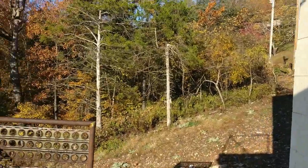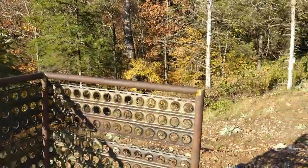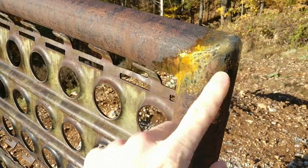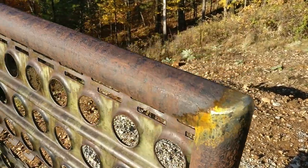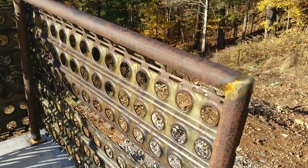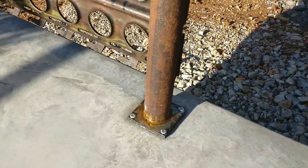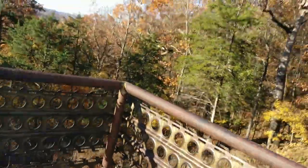I've finally finished the railing. It rained last night, so I'm going to let this rust a little bit and put the same rust-converting product on there to turn it back to black primer. I'll do that here and down here too. The chemical reaction works a lot better if it has a little bit of rust on it - the more rust, the better it seals it in. So I'm going to let it sit for another couple of days and get a little more rust on it.